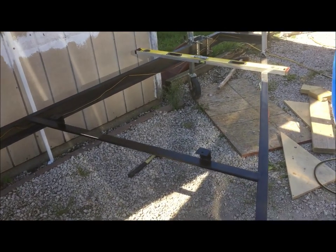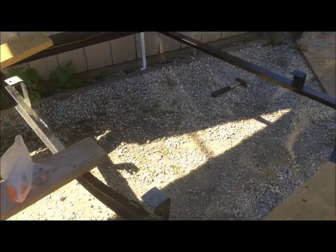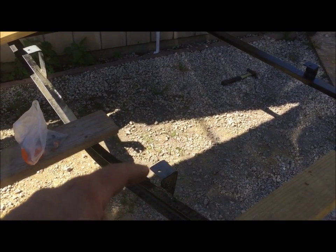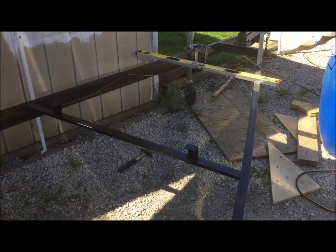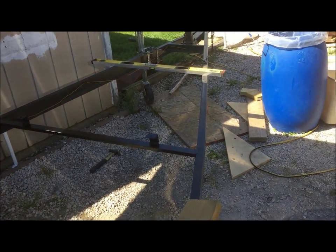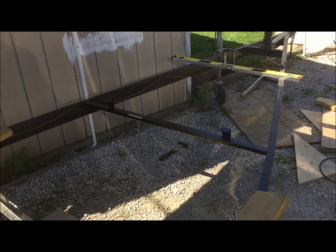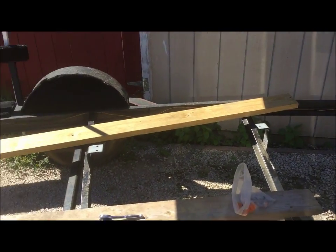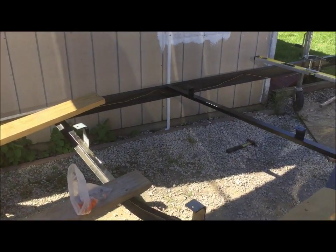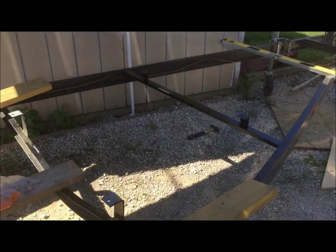What we did today: we had this front bar across the front of the trailer to give the ends of the bunk some support. Before, the support stopped right here, and with that overhang going out it was sort of more like a diving board than a trailer bunk. So I just welded that angle iron in and made a couple little brackets to hold it up. Then I got the bunks off — I'll carpet them tomorrow, I've got the carpeting in the back of the truck.